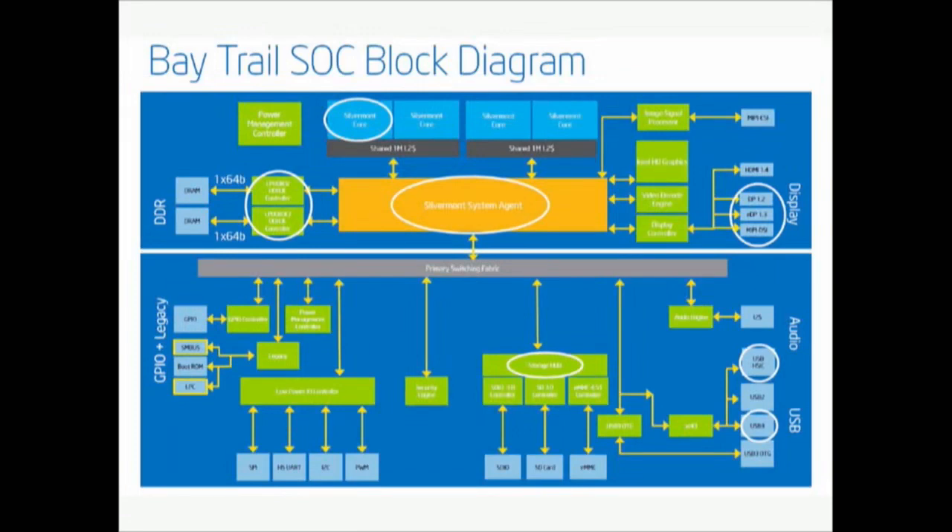You don't always see ARM stuff on an SOC. This is from a Bay Trail SOC that goes into a laptop. As you can see down there, there's even an old SM bus and what looks to be boot ROM and legacy stuff to hold all of the old x86 stuff that has been sitting there withering away in a corner, because nobody runs 32-bit x86 anymore, right?